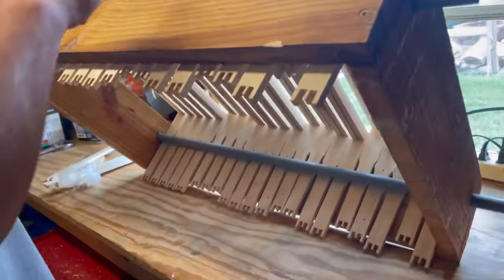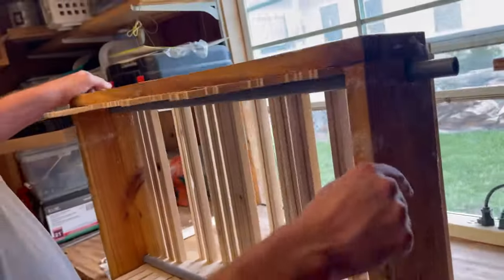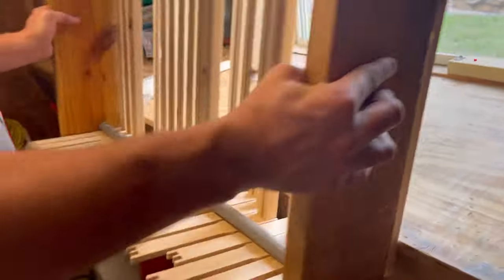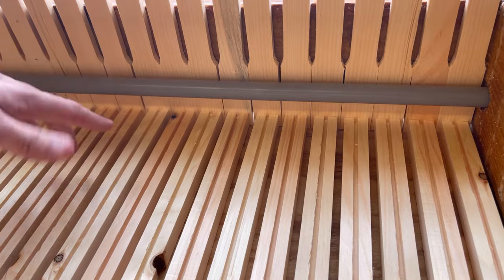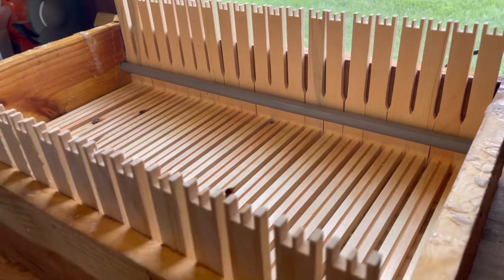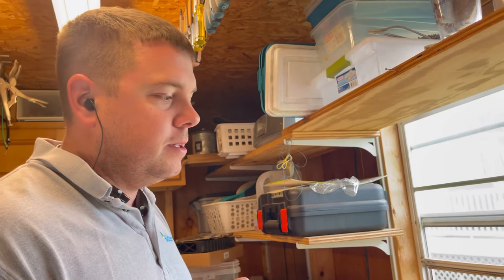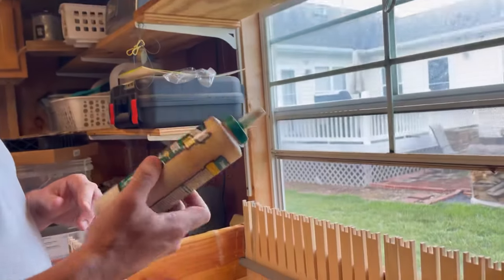We're going to run a grooved top bar so that we can slide an insert into it. You can see how the wood glue is just squeezed out amongst all those — they're all kind of flush. This is where the bar comes into play when flipping it over; it's holding all the pieces where they should be. Now if we look down inside here, you can see the wood glue is kind of mashed out. It's a lot of surface area, and that's going to be your most stressed point on the whole frame on a regular basis.